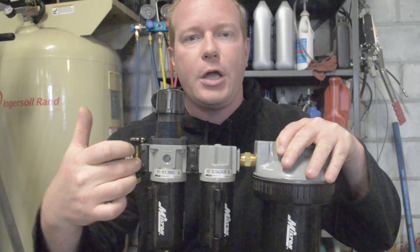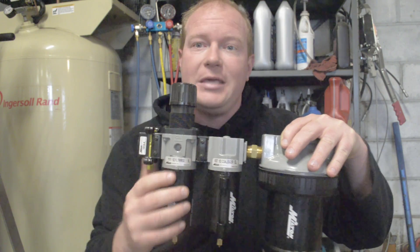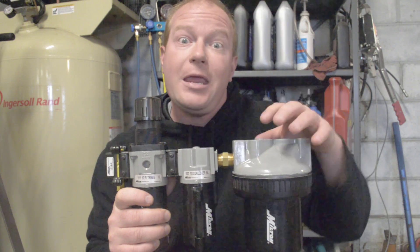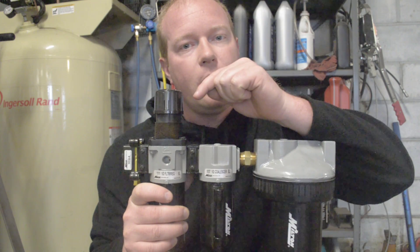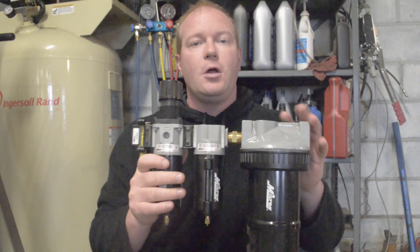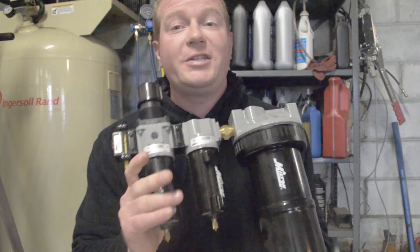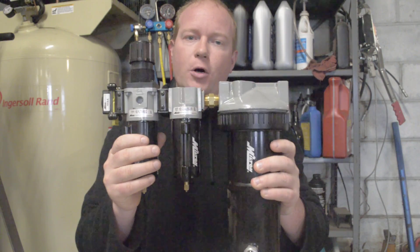They separate apart and you can take individual pieces out and exchange them back in. If you're using a lubricator and you don't want your paint air coming out of that lubricator, you can put in junction blocks that will divert the air away and run separate systems. The particular filter dryer system I chose has a regulator, a moisture filter, and a desiccant filter.